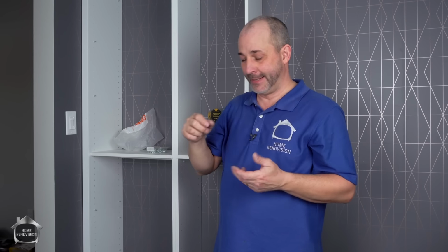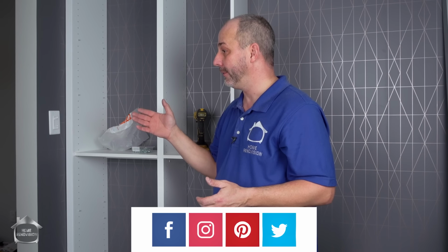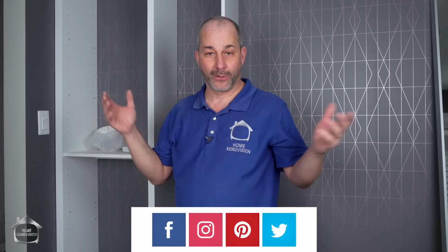The only thing that's left is to take out some 45-minute drywall compound, the quick set, make up a little bit of a paste, and thumbnail all of the little pinholes, because that's the perfect way to finish that off. That'll dry without shrinking, and then you can give it one more quick paint after you've done all your caulking work.